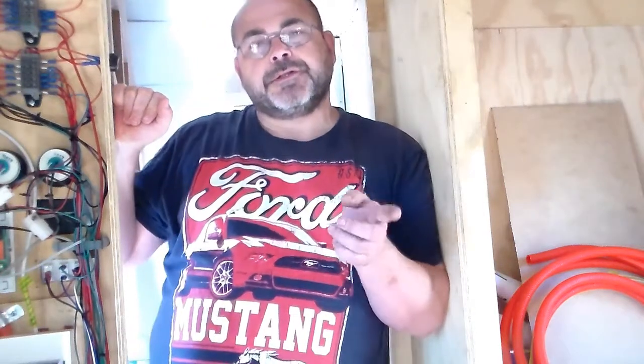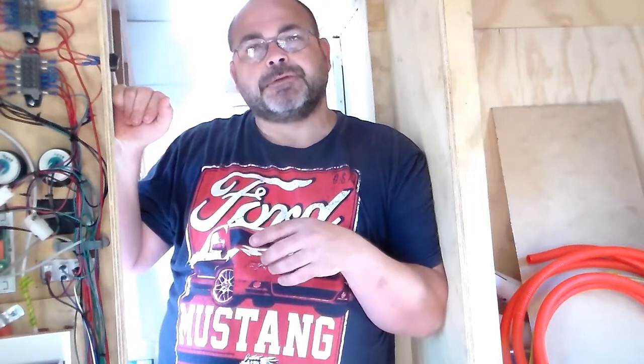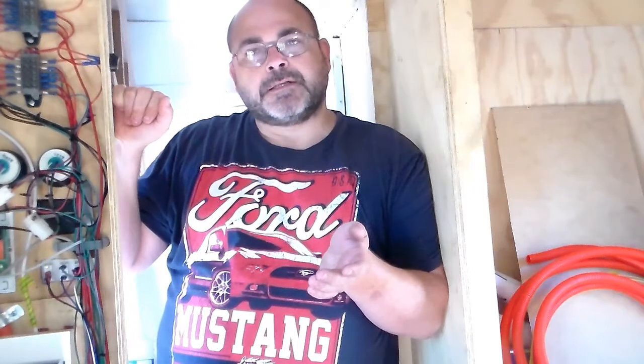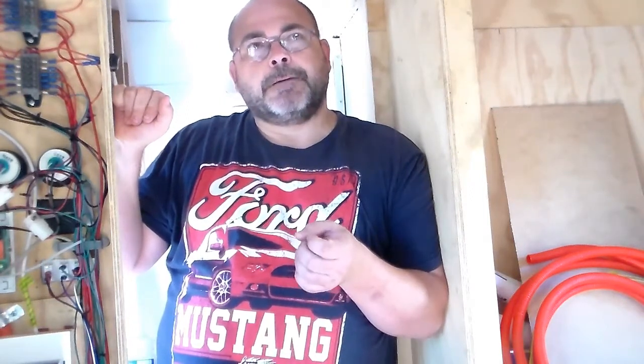One other thing I did just remember, for those people in New South Wales, where I'm living in Australia, if you're doing this sort of thing and thinking about certification, you will need certification to make it legal. Certification meaning it has to be looked at by a licensed electrician, and your engineer will need to see that certification. The certificate you need is called a CCEW form.